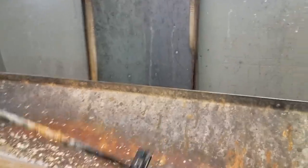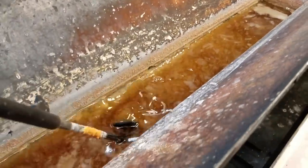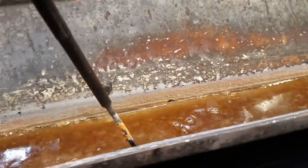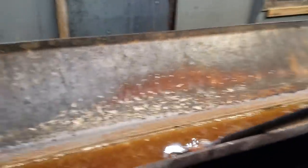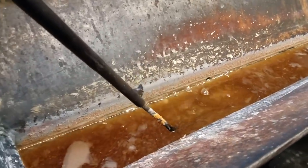I've got a new tool I made here — an old gun barrel and an old welding hammer — just something to crush the salts. I think Brownells even sells a fork specifically for this. You just want to crush up the salts. They're cold right now and when they get cold they crystallize into a chunk of salt. You can see the chunks floating around in there. It's definitely going to take two hands to do this. You basically just break them up real fine to where you can run your pick through it — right now you can't because it hangs up.